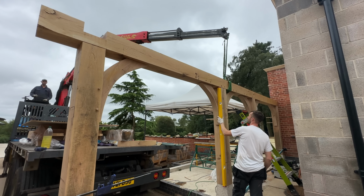It's gone pretty well. Just got this beam's a little bit long, so I'm going to cut a little bit off this end so that all the posts go back upright, because it's just being held by that brace stopping that joint from going down, because it's slightly out of level. So pull it all back level, should slip down nicely. We'll see.